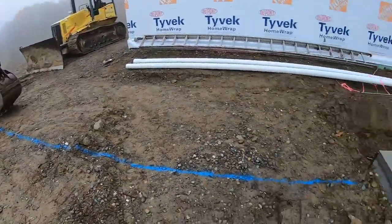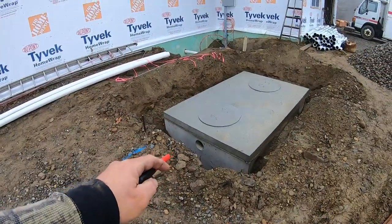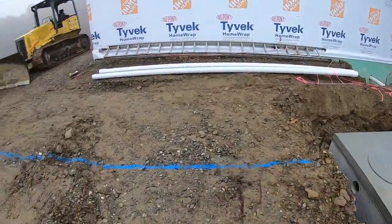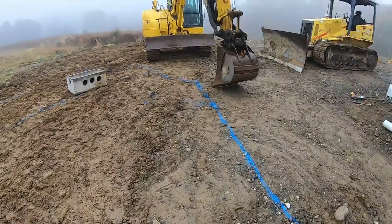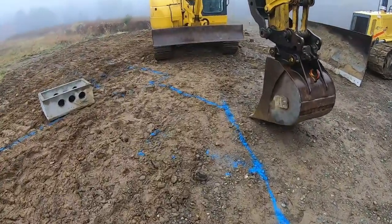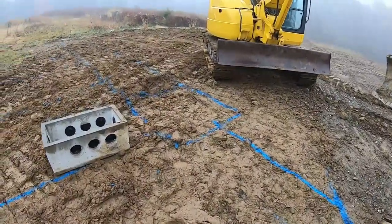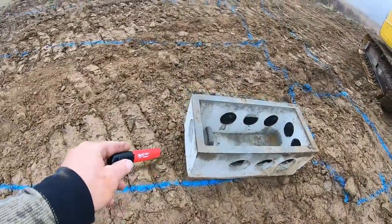So you got to shoot your stick on there, and if you're shooting from the top of the pipe, remember that when you go to measure from there or from the bottom of the hole, you just got to deduct or add 4.5. So basically, once you get this in and I excavate down to the bottom here,